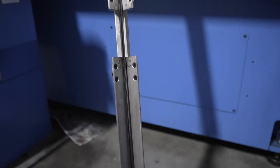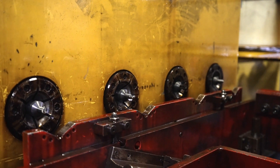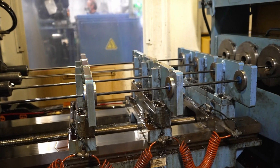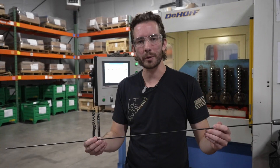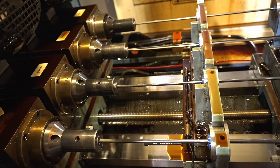The tip is a different material than the shank, so this is not a homogenous single monolithic tool. This is actually a steel tube with a carbide tip on it that's been brazed on, so it's very different than the twist drill. You'll notice by the name of the twist drill that one has a helix to the flutes, whereas this one is a straight-fluted tool, which is much different in function and characteristic. This process also uses counter-rotation where the workpiece revolves opposite in direction relative to the tool, which helps stabilize the tool over its cut and offset the effects of gravity over the length of the drilled hole.